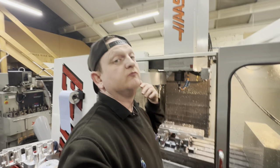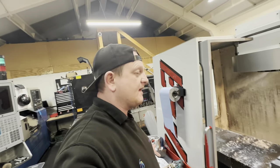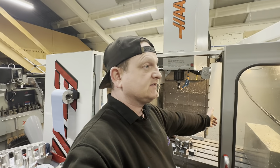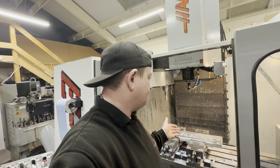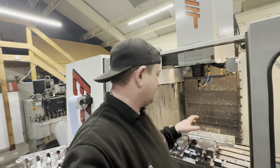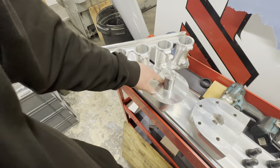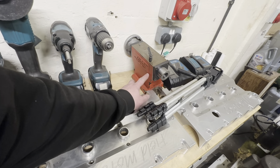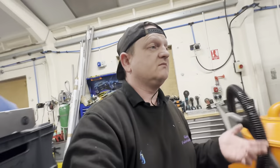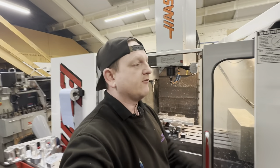Next I'm going to get packed up and go home, then we'll look at getting the plate bolted back together — get the end pieces back on, get it bolted up to the fourth axis, and then see how far out we are on this end and how we're going to go about aligning it. I'm also thinking rather than the bearing block, putting something else in here — a bigger bearing with a small ID and seeing if running it off the tail stock works better, since I do have a tail stock for the fourth axis. But the bearing block's easy if I get the heights right.